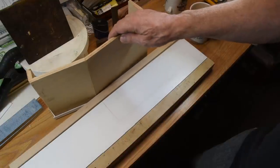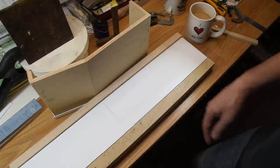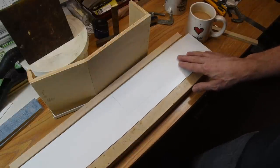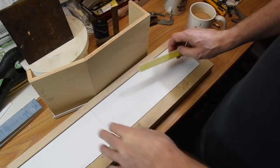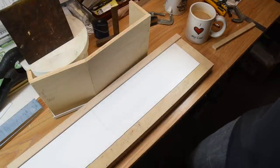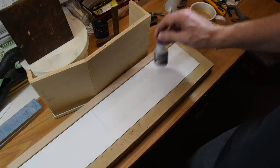I was going to cover that with masonite, like 1/4 inch or 1/8 masonite, but I didn't do it for some reason. So I'm going to do it with plastic. I got this scrap piece here. And what I did was I roughed it up with some 60 grit, right? You know how I talked about that? Rough it up good, give it some tooth, so when you CA it or use solvent, it really bites.